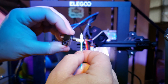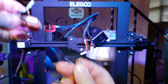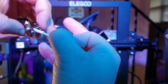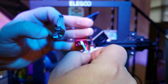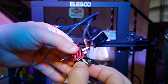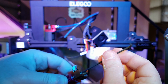Next, we'll put some boron nitride paste onto the shaft of the heat break, put a little bit inside of the actual cartridge hole on the block itself, and a little bit into the thermistor hole. Put a generous amount inside the heat sink. Slide everything together and give it a little spin just to distribute it evenly.